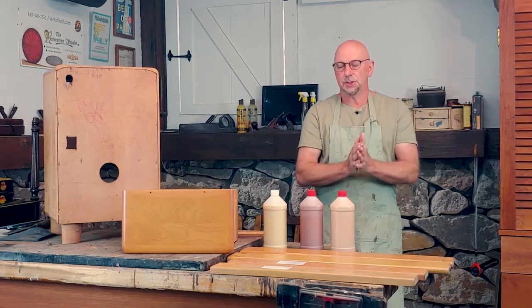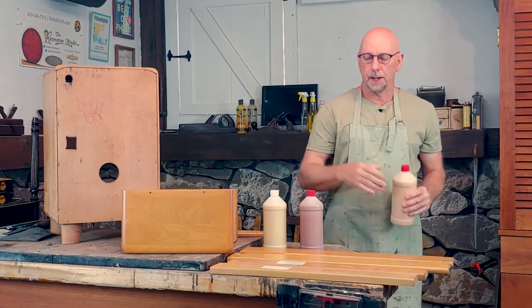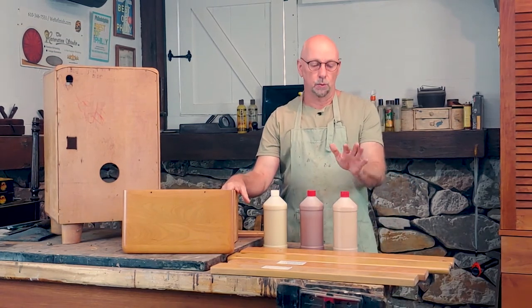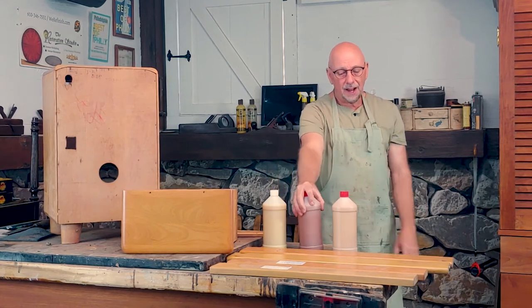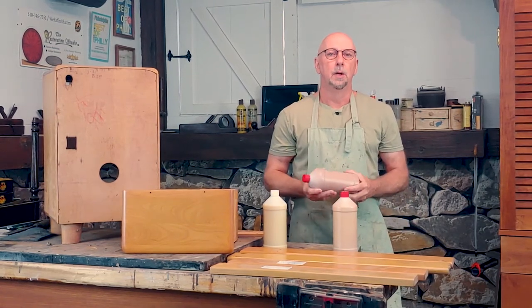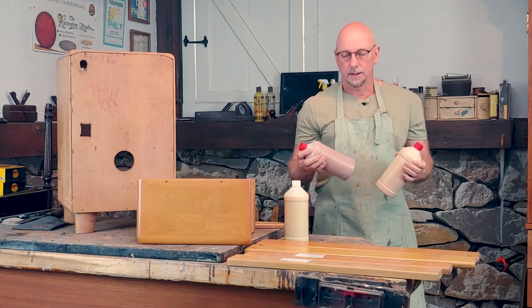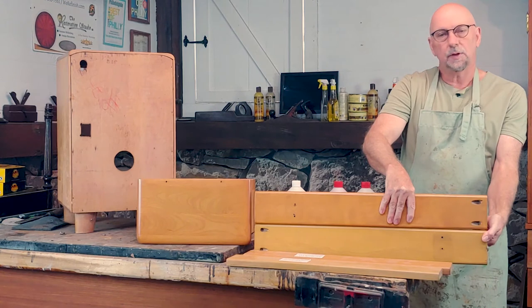Those are really the two main things you need to know — work fast and in small areas. As far as stain color goes, I've gotten some complaints through the years where people think it's the wrong color. As soon as they get it out of the box, they say the color looks like colonial maple and can't be right. It is right — this color is going to give you this finish. The wheat and champagne are the correct colors you need to get these colors as your final result: wheat on the bottom, champagne on top.